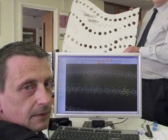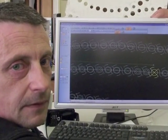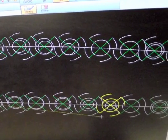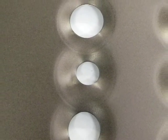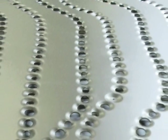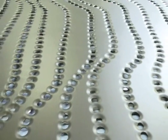To create the right visual effect, NES had to punch 1,100 holes on each panel utilizing six hole sizes randomly positioned but following the design artist's vector line on the panel surfaces. To accomplish the hole pattern, all holes were punched into the face of the panel so slugs fell free of the panel using Mate's slug-free dies. The panel was then turned over so the dimples were upformed from the reverse side into the punched holes.